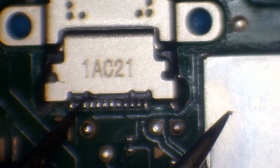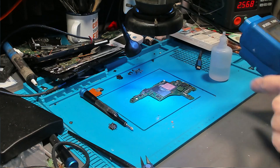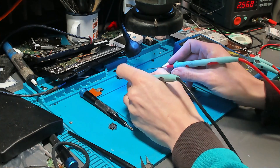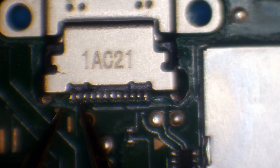Next we do the nudge test — that's to make sure all of the pins are solid and none of them are loose, confirming the port is soldered nice and solid. Then we take the multimeter and go into continuity mode to make sure there are no bridges underneath the port. We test each pin from one to the next, and also test the fuse.